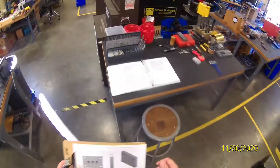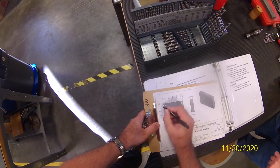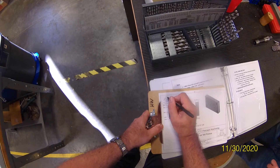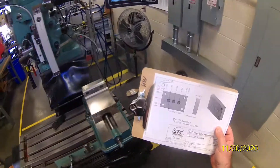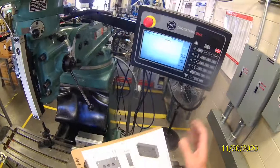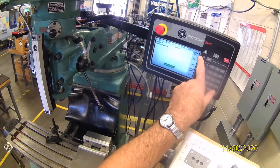So we're going to program it. This is our zero-zero, and we're going to program it to the print coordinates and tell the machine what tool size it is. I'm going to start over here — I'm going to put the end mill right about here and go in this direction, ending up here and crossing the finish line. So this start point could be like X minus one and Y zero. I'm going to program the rectangle and give it a name — I'll call it 1234. The ABS set is your enter button. Programming-wise, we've got positions or drills, mills, or arcs.